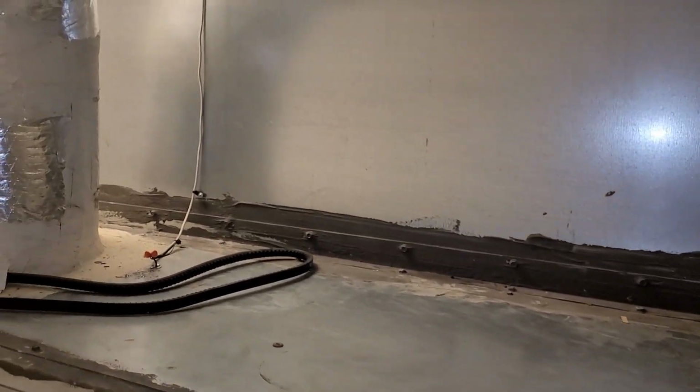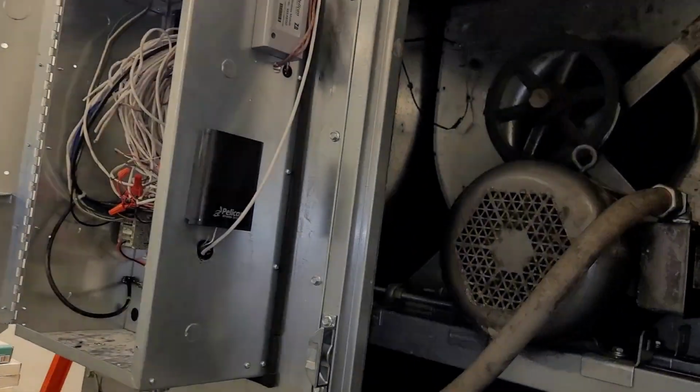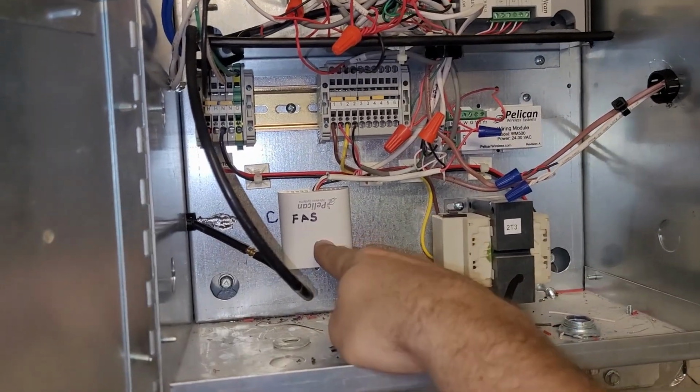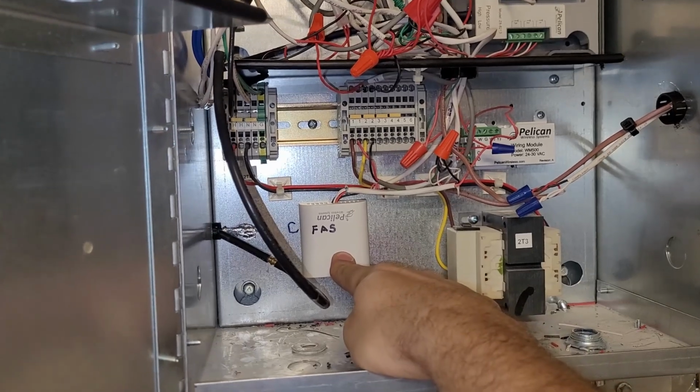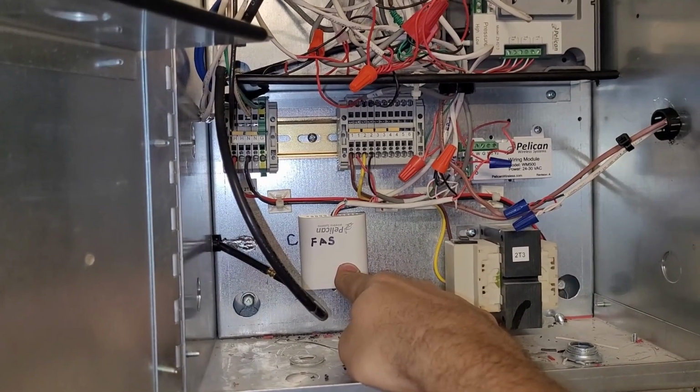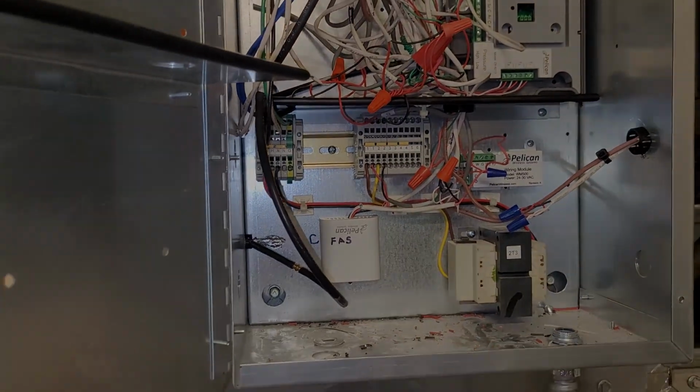So in the event of a fire, the VFD will shut down, so the main air handler fan will not run anymore, and also the outside air fan and outside air damper will shut. That way you starve the fire as much as you can. And then also you get the fire alarm. It'll create an orange banner, an orange alarm indication in the Pelican interface.